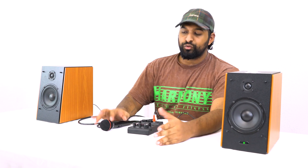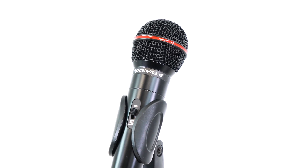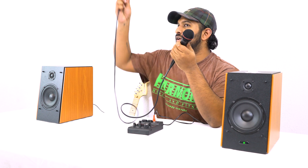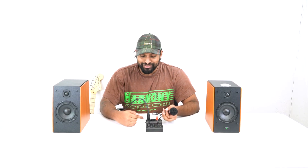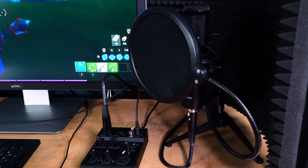Now that we're plugged into our speakers, we can use channels 1 and 2 for either a mic or line level signal. I'm going to demonstrate with a mic. I have a dynamic microphone — the RMC SR — with a female XLR going into the bottom of the mic, and the male XLR going into the combo jack on channel 1. When using the XLR portion it transmits a microphone level signal; when using the quarter-inch portion it transfers a line level signal.